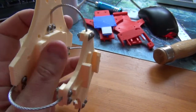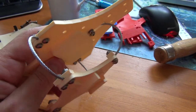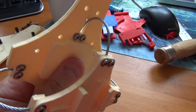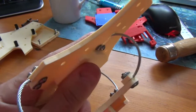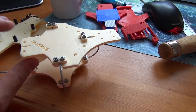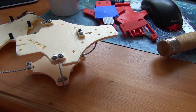I need to create a few options when putting it together as I'm not sure what size battery I'll use - I need the ability to swap things around. It's also oversized in width because I don't know where the center of gravity is going to be. I'm trying to keep the CG where all the legs meet, and once I know where it is I can trim some off this battery upstand to save weight. The idea is to get it laid out so I can get all the electronics, FPV camera, and GoPro mount sorted, then refine it.